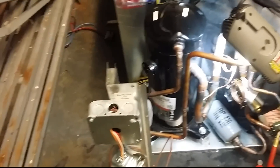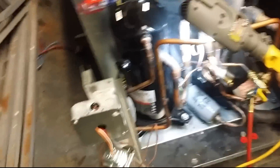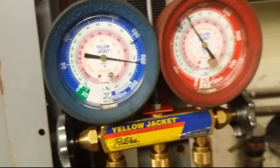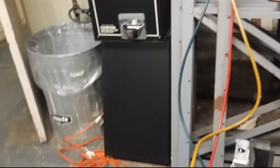We're going to pump this sucker with nitro and see what's happening, and we'll go to lunch. If it's holding nitrogen, we'll close everything back up, insulate everything — and that's what we had to do to change the TXV while we're holding pressure. I marked them. I'm going to come back after lunch, all repairs are made. We'll button it up, put the electrical panel up and insulate, re-insulate everything. I'm going to connect some hoses and test it out here before we take it off.